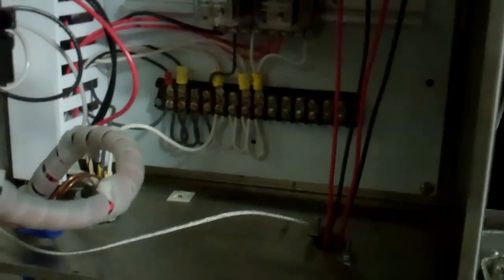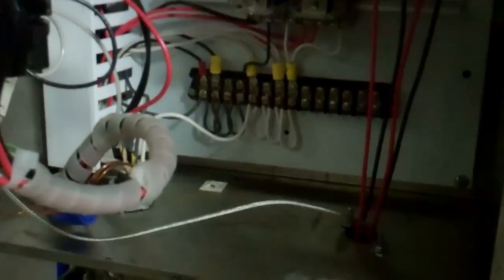Those wires go up to my heaters in my heat exchanger. I have some smaller relays here — one controls the pump. I have my distribution block where hot wires come in on one side and I loop them to distribute the power going to my other relays and lights inside the box. That's where all the mess of wires is — and the heaters just kicked on there, calling for heat. I'm not an electrician, I just taught myself how to do all the wiring. It seems to work, so I assume I did it right, but someone more professional could probably clean it up.